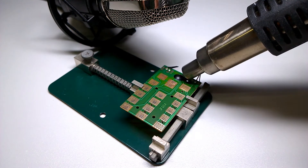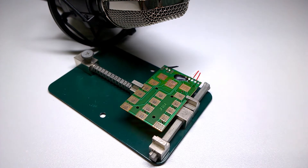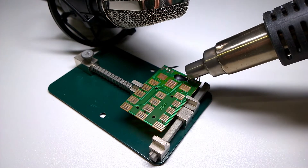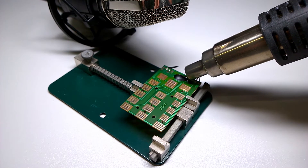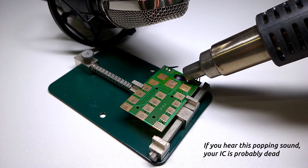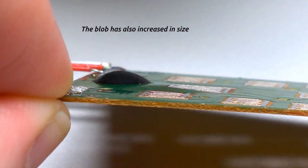And that's the other thing — not only do these chip-on-boards not like the heat, but these are phenolic PCBs. Their lamination is nowhere near as good as woven fiberglass PCBs. And as you can see here, it's developed a bit of a bump where it's delaminated.